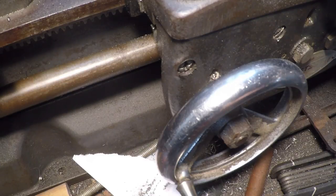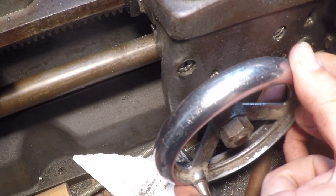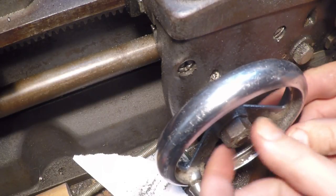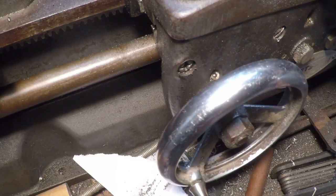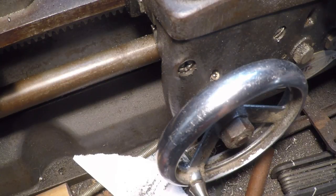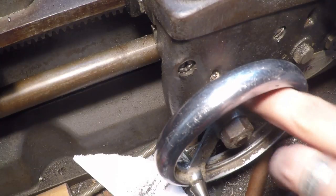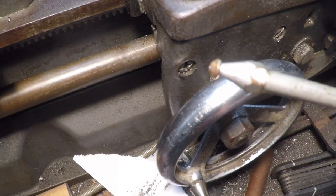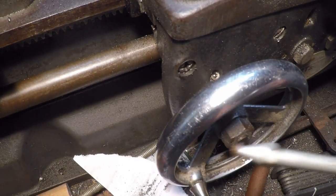One of the other things my heap was asking about are these oilers. My bushings are in really bad shape on that. Anyway, this kind of oiler here is not a Gits oiler — I'll show you what a Gits oiler is in a second. This is called a ball oiler because it has a ball with a spring behind it, and this here is the kind of oil can that you've been looking for — I've got a few of these.